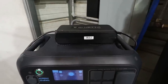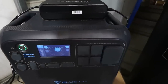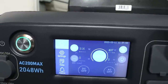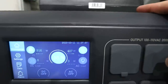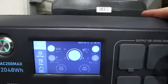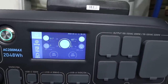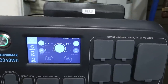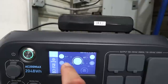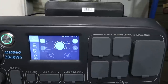Fan noise is barely noticeable — I'm only hearing the fan on the AC adapter, not on the solar charge controller. Bluetti claims 900 watts maximum solar input — we're maxing it out at 917-918 watts. The wall charger shows 487 watts. Add those together and we're at the full 1400-watt maximum input capability. With 2048 watt-hours capacity, at these rates you're charging this in a little over an hour to an hour and a half.